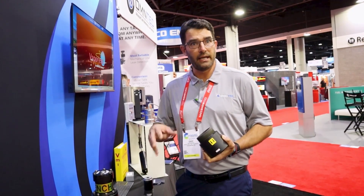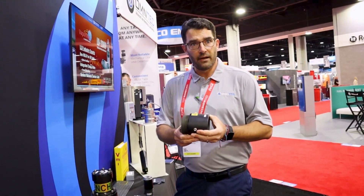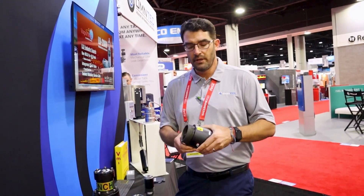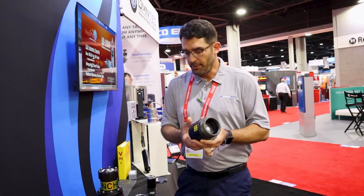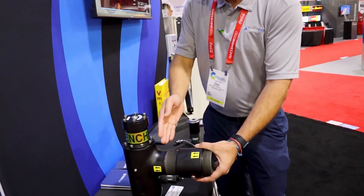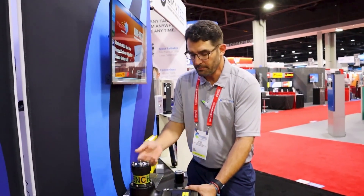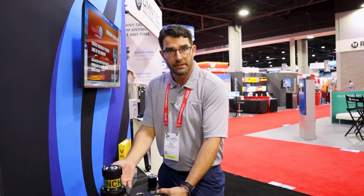It's a two-man job with a crane — you have to pull the pump to access the check valve. With this inline check valve, there's no need to go through that hassle. This can mount directly on the discharge of the pump, thread the leak detector into this check valve, and now we're maintaining pressure upstream of the leak detector where we need to, maintaining full flow position as we should, and not creating fueling issues.